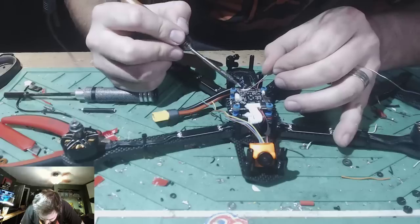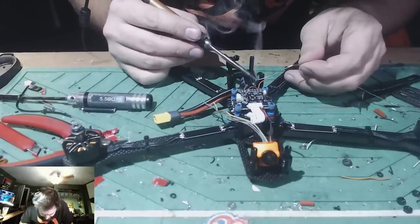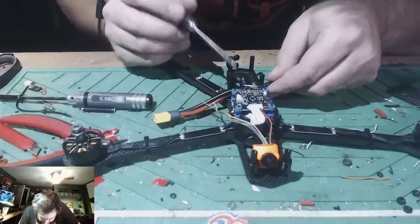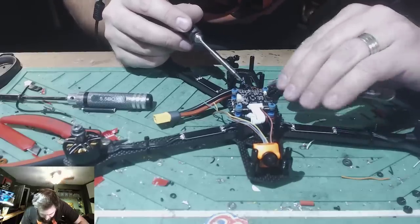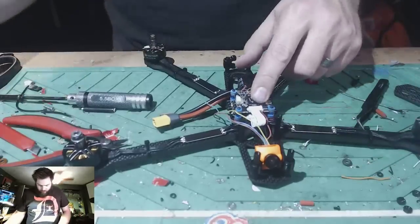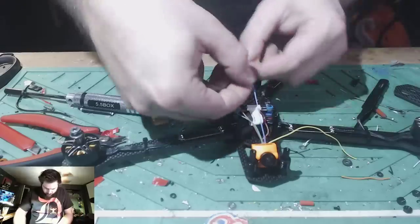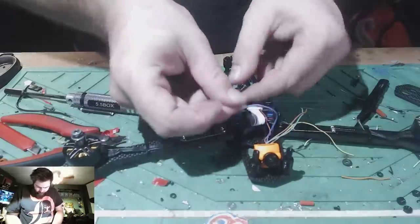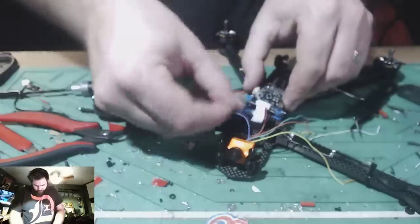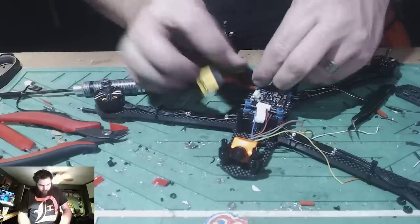All right, there's a 10-volt back here that I'm going to use for the camera, as well as the ground. Tin up these wires. That will help ensure noise-free video, as well as actual power for the camera, which is good. Okay, got that. And then the blue one is supposed to go straight to a VBAT. So I'm going to go around. Straight back. So I just pop that off. That's where I left it off. Oh, there we go.